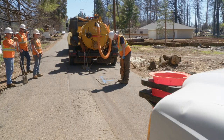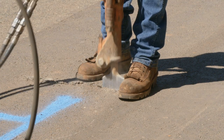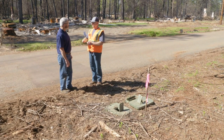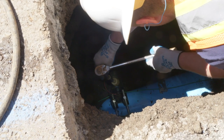The method for doing that is to actually excavate in the street at the water main. We will isolate at the corporation stop — the valve we will use to shut off — to now isolate that service line from the water main.